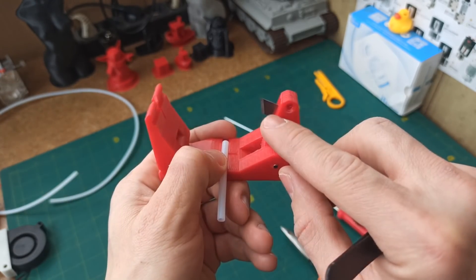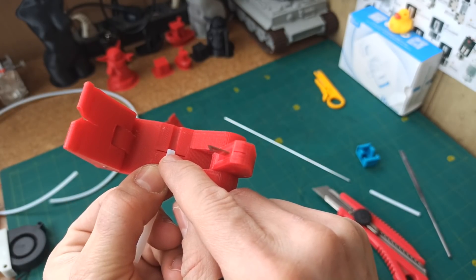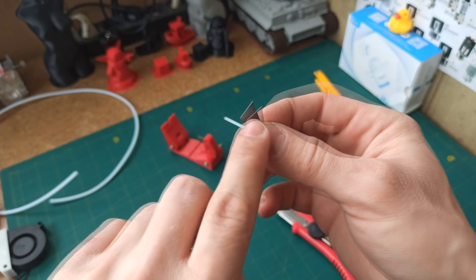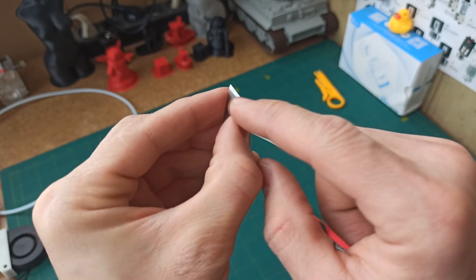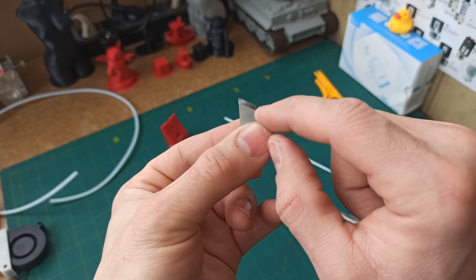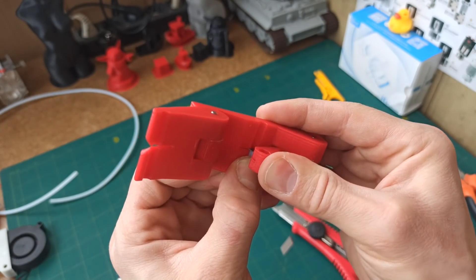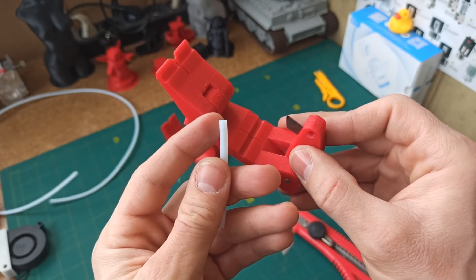I found a solution even for this situation. If you use a one-sided edge instead of a double-sided one — like a chisel — then you get a maximally precise cut even when trimming a tiny piece. Unfortunately, I couldn't find a one-sided blade online, so I decided to make one myself. I took a piece of knife blade — one side is sharpened on both sides, the other side is blunt. I simply sharpened that blunt part on a grinder, getting an interesting dual-construction: one side has a double-sided edge, the other side is smooth here and sharpened here — a one-sided edge. Let's insert it and test: no play at all. We place the tube almost at the very edge and trim. And here you go — 90 degrees around the entire circumference, because with the one-sided blade you can easily trim even a tiny piece of teflon tube.